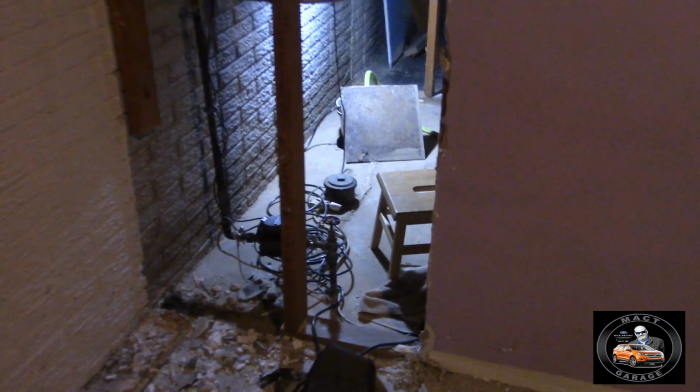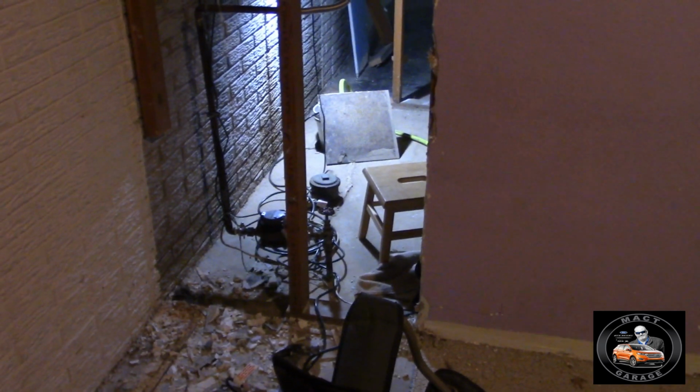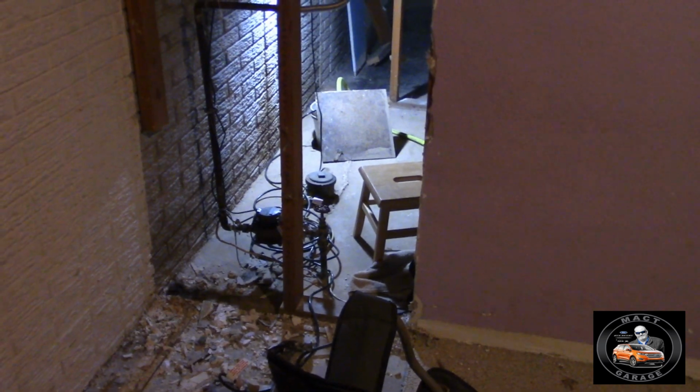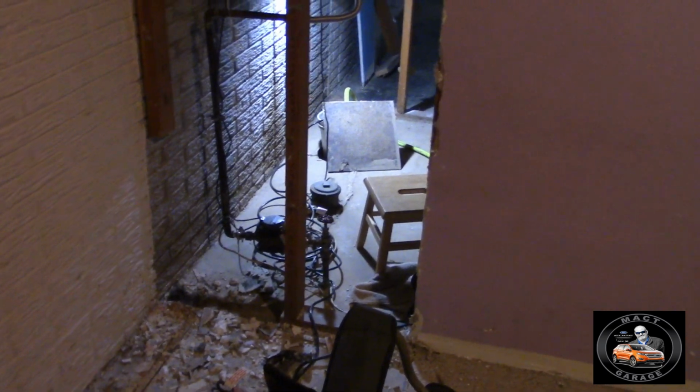They're going to come all the way up to the side here around the corner, dig the foundation up, and then go all the way over to the sump area. Now the sump's going to be a primary electric with a battery backup sump. So there'll be a battery back there and everything.